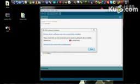So if you're on Windows, which I am, you're going to have a problem with the Arduino Uno not installing the driver properly. This is because of a change that they made to the USB interface on the Uno board from the older version of the Arduino boards. If you have an older version, it should just install automatically. If you have the Uno, though, you'll have to follow these steps.